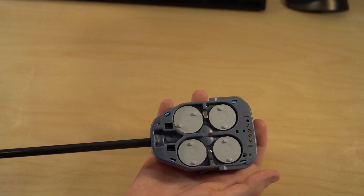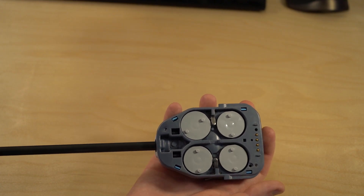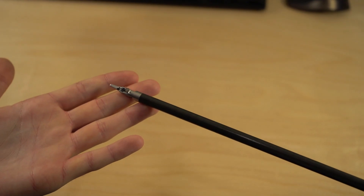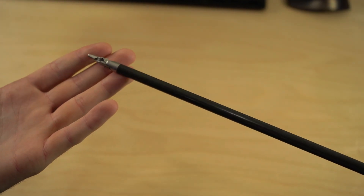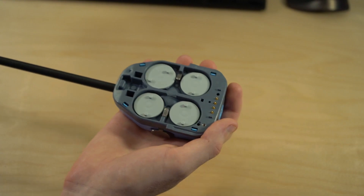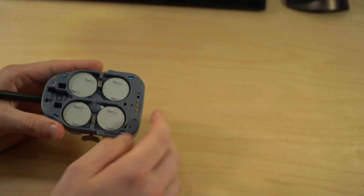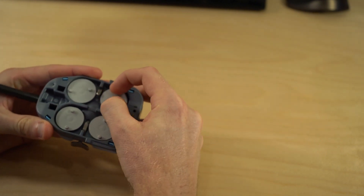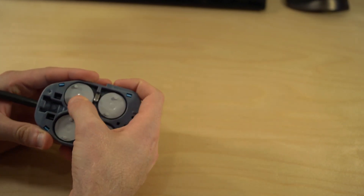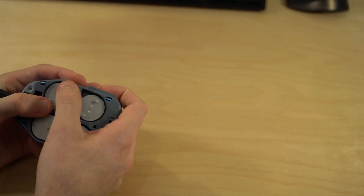Then there's also four degrees of freedom within the instrument, which is what we're going to take a look at in detail. The distal end of the device is called the endo-wrist, which has the gripper and a wrist mechanism. That's all controlled at the proximal end of the device, which has four knobs that control each axis of the device via servo motors in the arm.